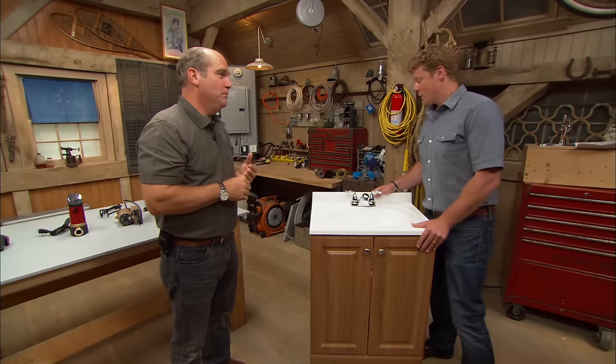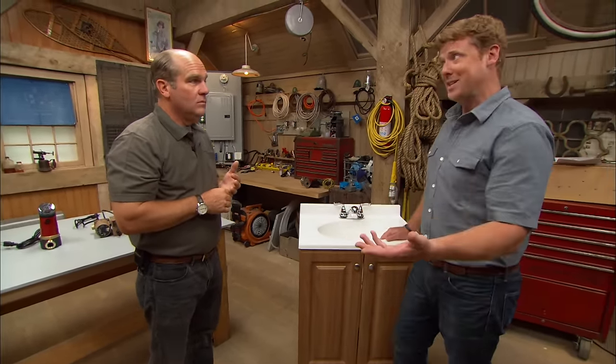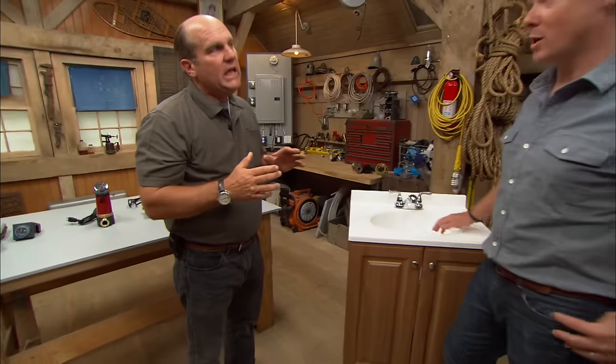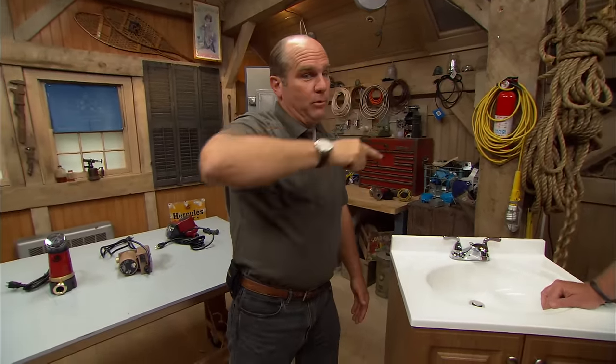Very nice. Okay, so it sounds like it's great for convenience and comfort. Are you worried about waste? Because now we've got water circulating and pumps going. It always worries me that a recirc line improperly controlled could be one of the biggest energy wasters in the whole building. Because what you're doing is taking perfectly good heated water that was in that tank, circulating it through the building, bringing it back, letting it cool off, and bring it here, and then makes the burner fire again. So you want to do it right.